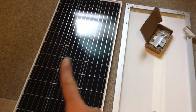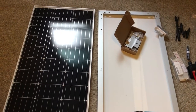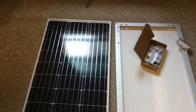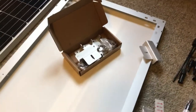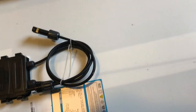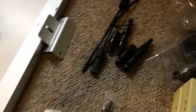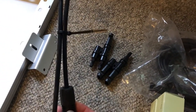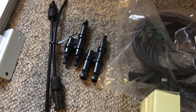This is my setup. I've got two 100-watt solar panels and I have the ability to add more if I find that's not sufficient, but I think it will be. This is what the front of the solar panel looks like — it's pretty durable — and this is what the back looks like. It has these nifty watertight connectors. These are the brackets which I have not installed yet. I decided to go with parallel wiring. If one solar panel is faulty, the other one will still work. These are the watertight connectors that allow you to hook them together in series or parallel.